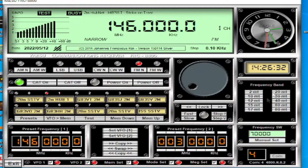You can click around from there - that's what the frequency band option does. We've also got a Frequency SW option where you can manually set the frequency by typing it in. So if I type in 7 MHz and click Manual Set, it'll take us down to 7 MHz. If I want 7100, I type that and click Manual Set - that's how you type in a frequency manually.